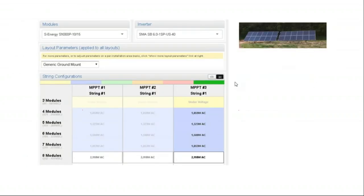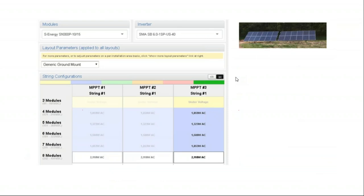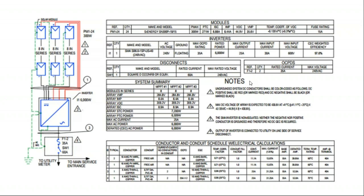What we're showing is some wire sizing. The way I develop my line diagrams, because most of the solar design software out there, even the most advanced one called PV Complete, and this was done in a cheaper program called Solar Design Tool, which is only geared towards smaller residential projects. But generally what I'll do is design the system first using manufacturer provided sizing tools, so this is the solar inverter sizing that tells how many modules can go on which inverter, solar only. And then I'll model that design in computer software that generates a one line diagram that lacks battery capability. Then I'll export this file to CAD and hand draw the battery components to it.